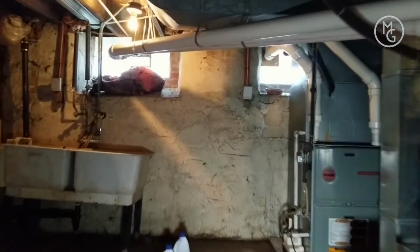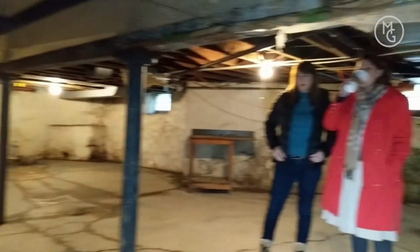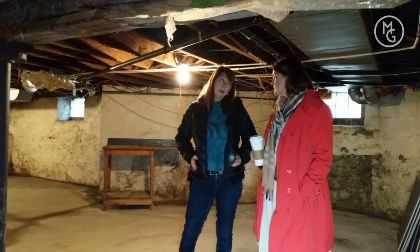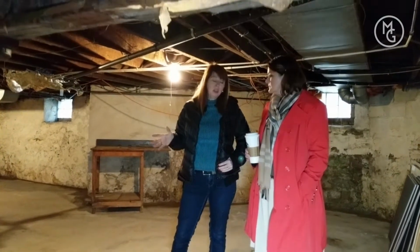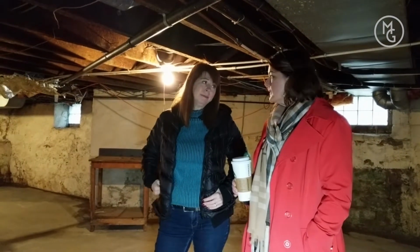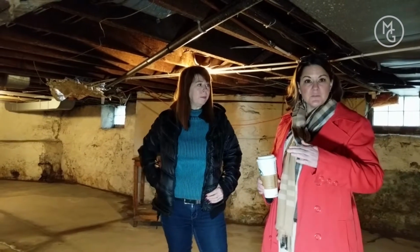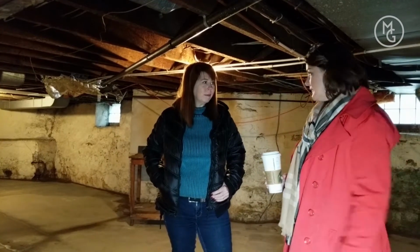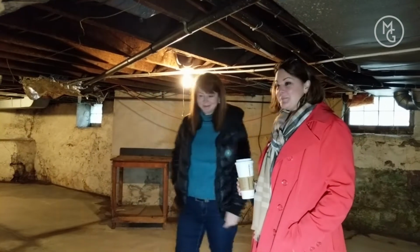So how are you going to do the washer and dryer? Are they going to share it? That's my objective, but if I can't do that, I'll have to put in 2 sets or just have laundry hookups and tell people that they can bring their own. Okay. It's a possibility. Right now I'm trying to figure out all this water infiltration. I think I have a gutter problem, and so I'm trying to figure out what's happening with that. Most basement leaks are from the gutters or from improper slope of the dirt on the outside of the foundation. This one though might not be completely it, but you never know. I'm hoping so. That's where I'm starting. Yeah, it's the best place to start.